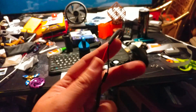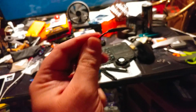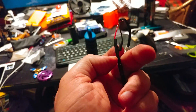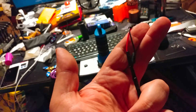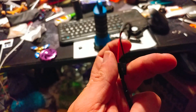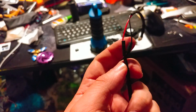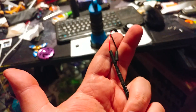I kept this piece of cable with shrink wrap on it, cut two little pieces off, and after splicing the cable I put the shrink wrap over the ends to protect them, then I'll slide the larger piece over top once I shrink them. This way the splice cannot short inside the 30 amp power supply, since that would be bad.